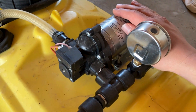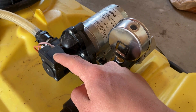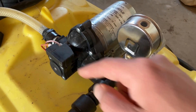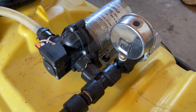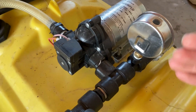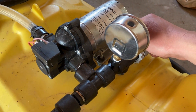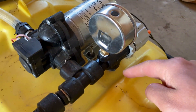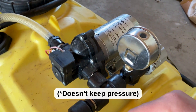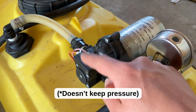We know that the motor runs when the pump is turned on and the switch is actually shutting the motor off, but somewhere — either a leak or in the regulating valve — liquid is still getting through even when the regulating valve is closed and nothing should be bypassing back to the tank. The system is not trapping pressure, so it never reaches the shutoff pressure of the pressure switch.